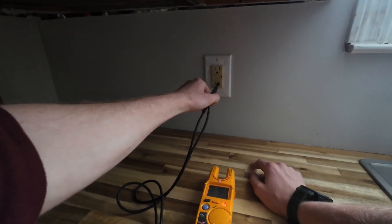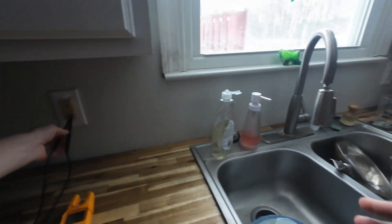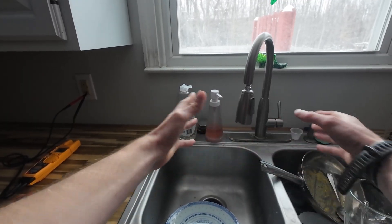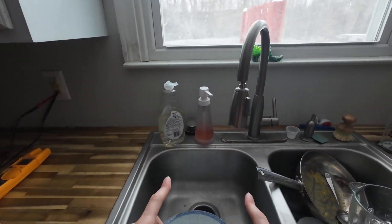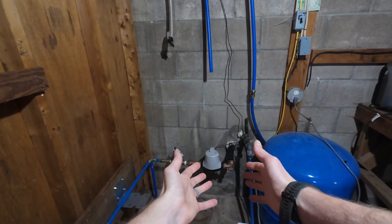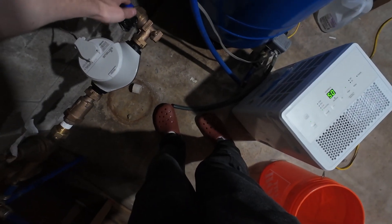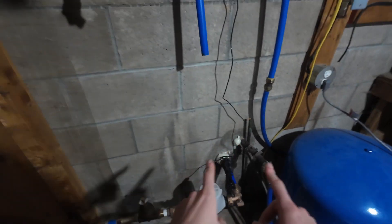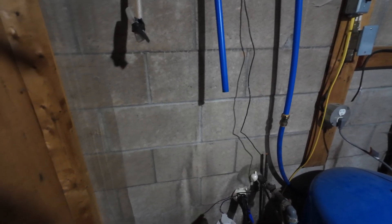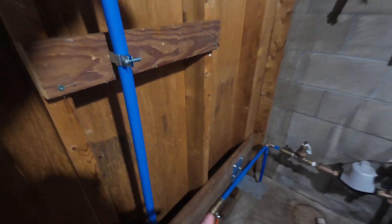It might just be a loose wire in the back of the box, but we'll take this apart. Since we have a sink right here, we should have a grounded path to the sink — our water pipes are grounded. But in the basement we have a plastic water service, which is pretty common. So here's where the water service comes in and they use this new plastic pipe, so obviously you can't ground plastic. You are supposed to have a ground rod and ground your water system — I believe it's within six feet of where it comes into your service, but that's not here.